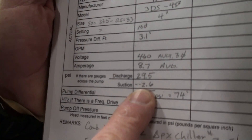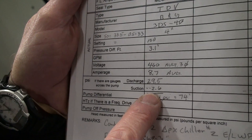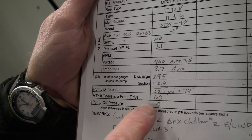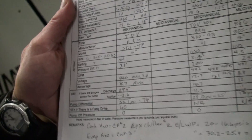That's the only thing I see that's a little odd on your job. You can just add glycol pressure to the system and both these numbers will go up. The suction is awful low — it's a vacuum in all three pumps. That's the only weird thing.